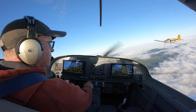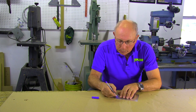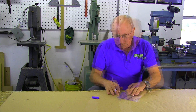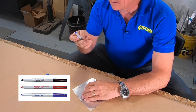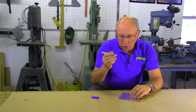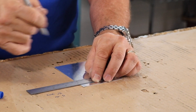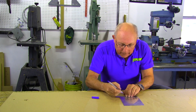It's a fundamental skill if you're building a metal airplane. The first thing you need to do is measure accurately. We don't have anything specific that we're working on here, so we'll just draw a nice accurate line about a half inch from the edge of our sheet and mark it with a fine line sharpie. You want to get a very fine sharpie — for some reason blue seems to last the longest. We draw a nice straight line and put one here a half inch from the corner, let's do a couple of them all a half inch apart.